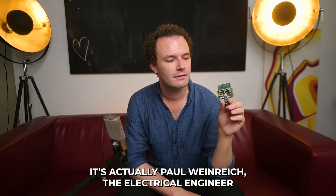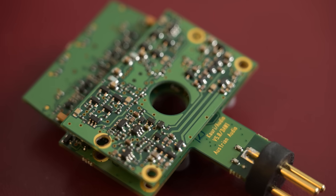When we take a look at the PCB, we can see some larger components — for example, the pattern switch. We can look at the front end of the microphone. The purpose of the front end is to configure the capsule either to sum the two signals together into one signal, or to split the signal into two outputs. The output coupling capacitors block the DC of the P48 phantom power. On the back side is the power supply board — a separate board used to control the voltage applied to both sides of the capsule. All of this is controlled by a microcontroller where all sensitivity values are stored during calibration. The circuit layouts are made in-house, but the PCBs are supplied by a specialized partner 30 minutes from here.